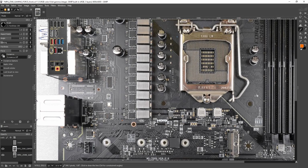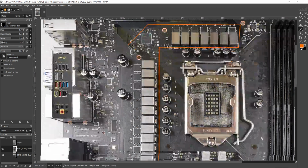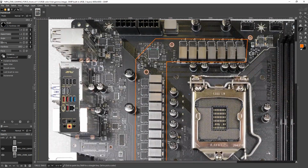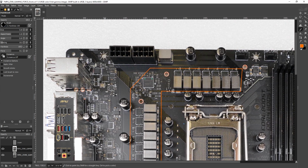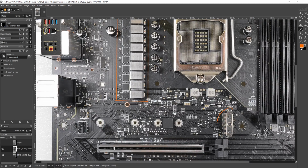Anyway, let's talk about the power delivery. Man, 11th gen makes talking about Z590 motherboards just always suck so much. Because would I actually buy an 11900K? No. Absolutely hell no. I'd buy a 10900K and put it in a Z590 motherboard anyway. Because there's really not much of a difference between Z590 and Z490 boards with 10th gen CPUs. In fact, there are a lot of Z490 boards that have this exact M.2 slot with the exact same configuration where it won't work without an 11th gen chip.